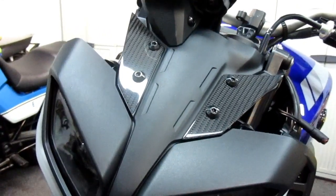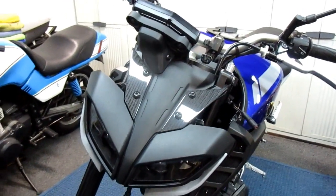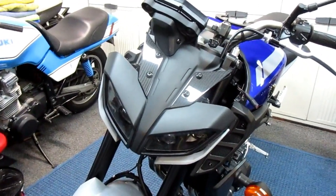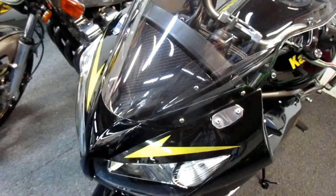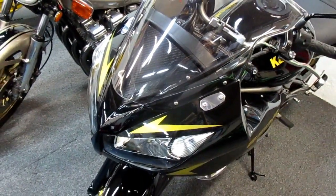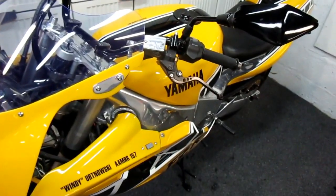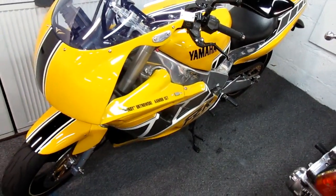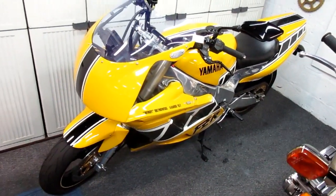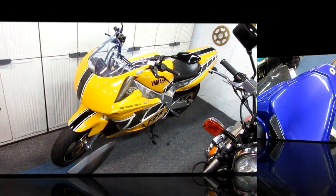And one of the hardest things on carbon fiber, when you make the carbon fiber yourself and you lay it up, is getting rid of the mold release agent and dealing with the fish eyes. Sometimes you have no fish eyes at all, sometimes you have just a few, but you still have to be prepared to deal with any fish eyes that are in that part. It's one reason why I like to buff out all my painted parts and the finish that I put on the carbon fiber parts. When you do a final buffing, usually it lets you eliminate every single one of the fish eyes.